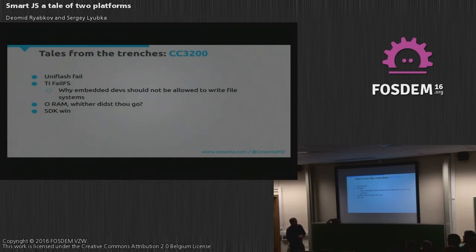The problem is that the Cortex M4 core lacks any kind of memory management unit. They didn't think about implementing it. Usually, the controllers have embedded flash that just sits on the system bus, so it's directly mapped, it's all good. But here it's SPI, it doesn't have any direct mapping like the ESP does. And it's really a big disadvantage in that way.